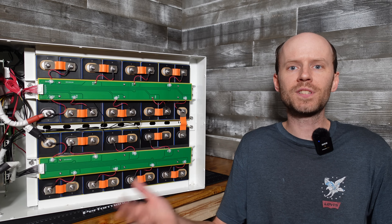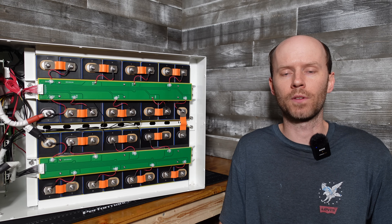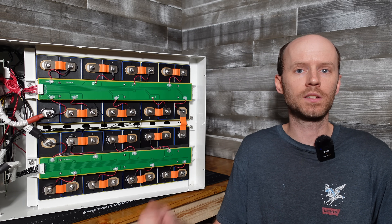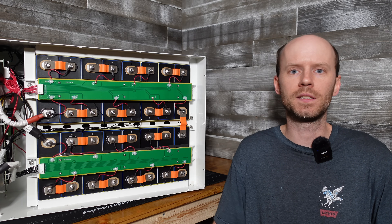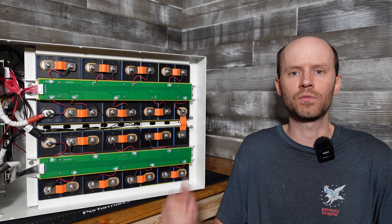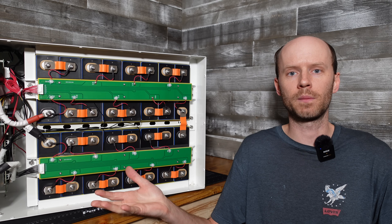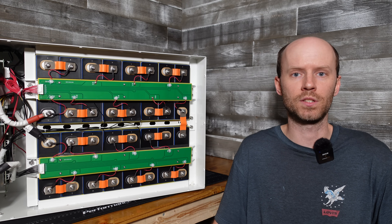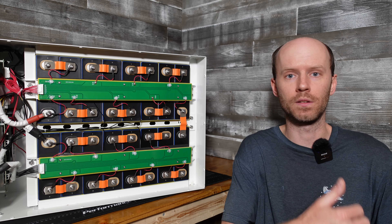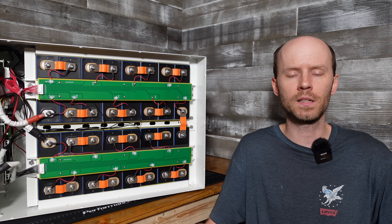You just can't beat the ease of assembling one of these — they provide everything you need to put your battery together, other than the cells. I do wish it had a circuit breaker on the front, not necessarily for overcurrent protection, but it helps with isolation if you've got several wired together in parallel. The one disadvantage — and this applies to all these battery kits, not just this brand — is the sheer weight. This weighs around 200 pounds and that's not going to be easily moved with one or even two people. You really need some sort of hydraulic lifting dolly to lift it and wheel it to where you want to install it. These kits can be ordered on Alibaba — they don't have any U.S. warehouse stock unfortunately. I recommended that they stock some in a U.S. warehouse, as these products would sell a lot better if you could simply order from a website with calculated shipping dispatched from a U.S. warehouse. They told me their customer base is shipping to the European market, which is where they're focusing their effort.